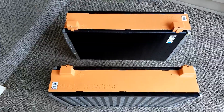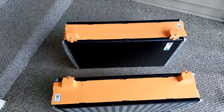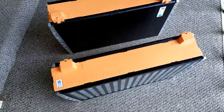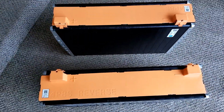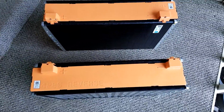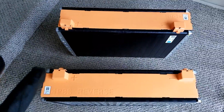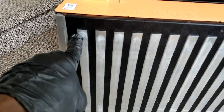Mostly anything I buy, I'm trying to make sure this battery is going to be configurable for 12, 24, 36, or 48 volts. So this one's already configured for 24 volts. I can just series them by flipping this one the other way around and we can have 48 volts. So I need two pairs of these batteries. But since only 3 are left and they had the 36 volt ones, I decided not to go with 36 volts. They are all stacked modules.